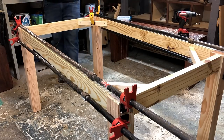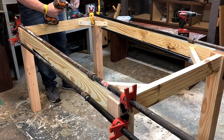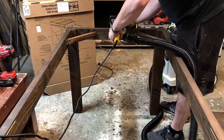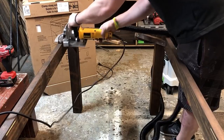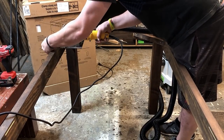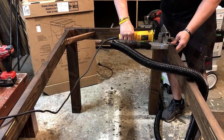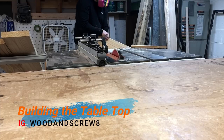I have a bunch of miters cut already, and I pre-drill in the side of them, then just put one screw on each side and put a little glue on there as well. That'll prevent the dowels from pulling out. The way I attach the tabletop is I use my biscuit joiner and cut a little groove, and then I have these little buttons — I'll link them below — that slot into the biscuit groove, and then I screw it into the tabletop, which I'll show at the end.